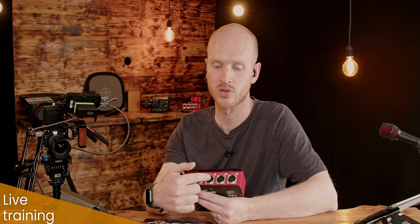The way these boxes work is they take the copper cores of the Cat5 connector. In a Cat cable you've got orange, green, blue, and brown with two of each colour — so it takes orange for hot and cold, green for hot and cold, blue for hot and cold, and brown for hot and cold, and then the shield of the Cat5 is the shield.